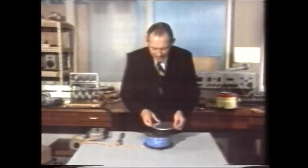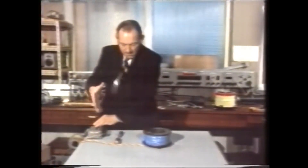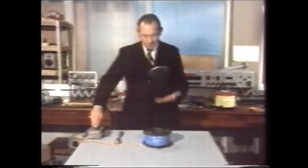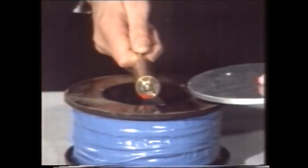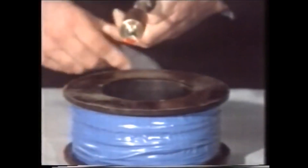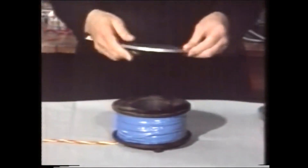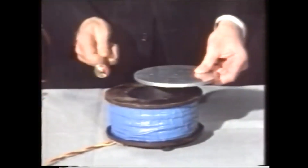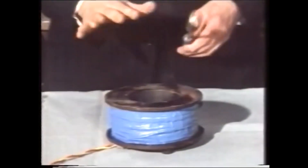But if we place the plate not in the middle of the coil, it doesn't jump straight up — put it to this side, put it towards me, and so on. Let us use this spinning cylinder again to see what's going on. Switch on, put the cylinder in the centre — nothing happens. Introduce the plate and it spins; introduce the plate from the other side and it spins the other way. Notice which way it's trying to throw the plate out — so trying to do this is like trying to balance a pencil on its point, you just won't succeed. But this idea of producing travelling fields has given us an idea: if we could only produce inward travelling fields without the plate there, then we might have a chance of holding the plate in the middle.